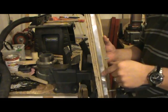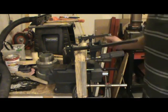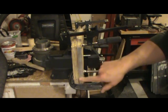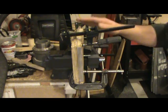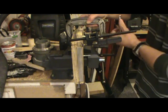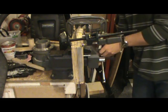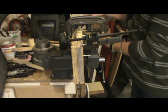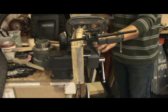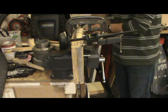If you have this part resting down against the vice, you'll end up with a dent and a scraped-up piece of metal — that's a big problem. Now here you can see the part I was forming on the other side: it's nice and smooth with not much ripple, quite straight. All I have left to do is form the top curvature. I'm transferring the clamps to the top of the rib, using several clamps along the very edge of the form block to keep the two form blocks tight together where we're actually bending the metal.